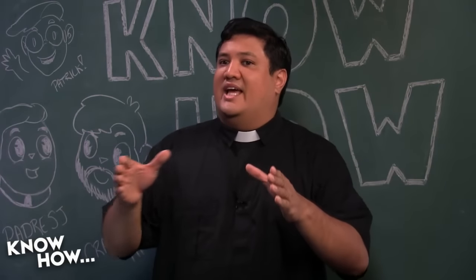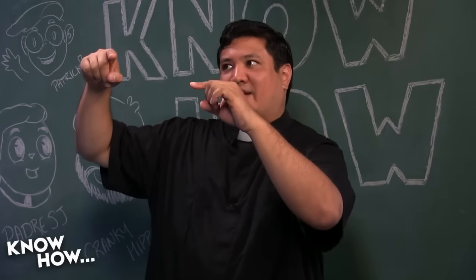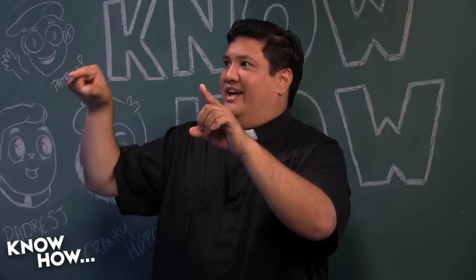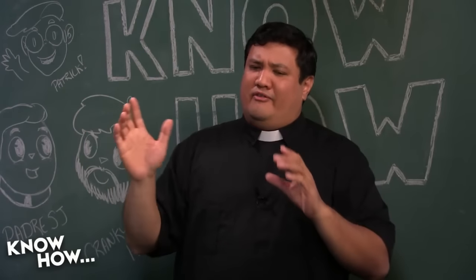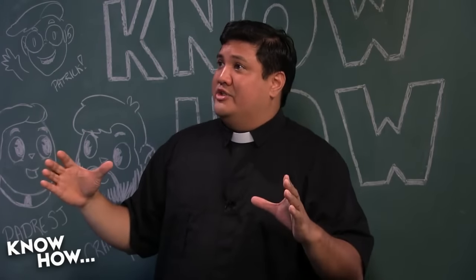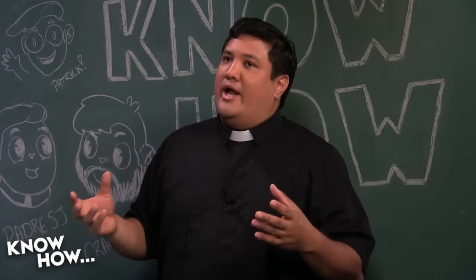I think that we would need to take an average of these numbers and just kind of take a range and kind of standardize it so that we're not blinking back and forth between multiple values. Precisely. So what we want to do is we want to say take 10 readings for a particular pin. And yeah, we may have those erroneous readings like it's going 99940, 99990, okay? Yeah, we got to throw out that junk. Well, we're going to do that later. Eventually we want to do an average but get away from the deviated mean. So we're going to chop off the top and the bottom. But for now, we can probably get away with just taking an average.